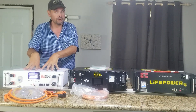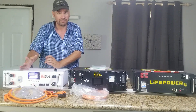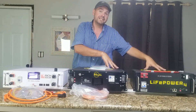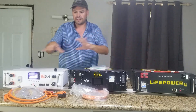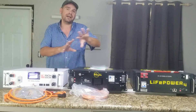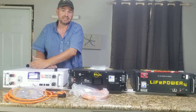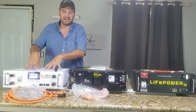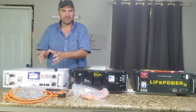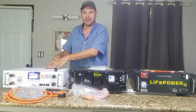Rich Solar, as of June 2023, really needs to step up and get more information on this battery. Also, this is a 15S battery where most other batteries are 16S — that's why those are 51.2 volts. This is actually a 48-volt battery, so it's not going to get up to 51 volts and it won't have as many amp hours or watt hours because it's 15 cells instead of 16. So I don't really recommend this one right now, though I'd possibly reconsider it if they fix some of the issues down the road.